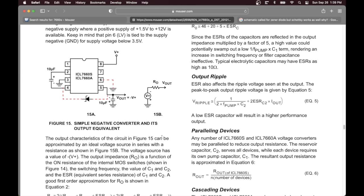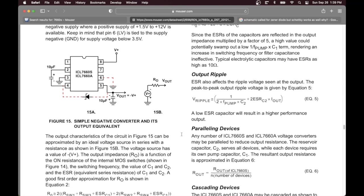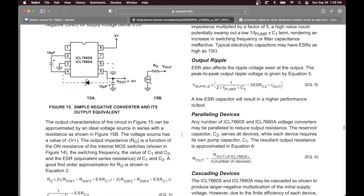Okay, welcome back, guys. This is part two of I don't know how many of building a 4116 or other RAM module testers. We left off with we had just done the step up voltage from 5 to 12 volts from the Arduino Nano. And now we're going to look at getting the negative 5 volts.